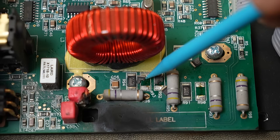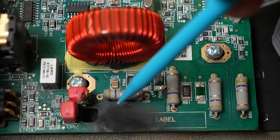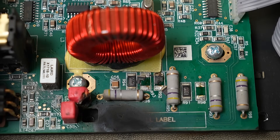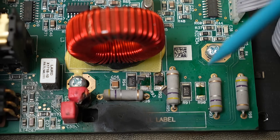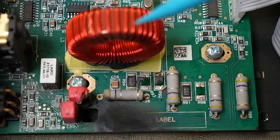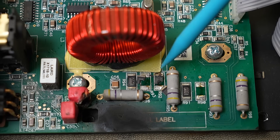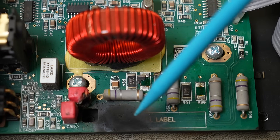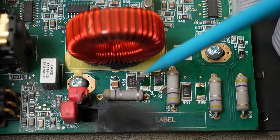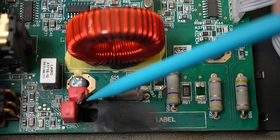We've got exploded power resistors — surface mount — they've gotten so hot that they've melted their solder connections and blasted themselves off the board, with little bits everywhere. We've got some serious plasma flamage ejected from what used to be a film cap. This looks like the output area, because you've got your Class D amp and that's the filtering stage — Class D switches at high frequency, so that filters out the EMI so it doesn't create a big antenna transmitting hash to every nearby device.